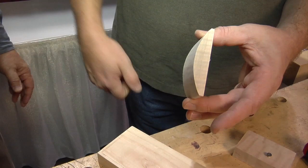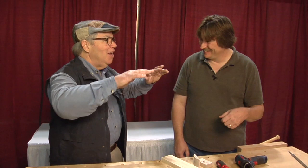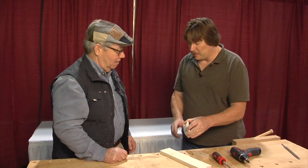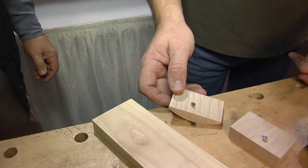That's the quick and easy way to do a scratch bead. Can you stop short? I can bring it up to the end and scratch bead across the end, bringing it right into the corner — so if you were doing a drawer front, really easy to do. On the ones I make for my shop, I make the outside round, so I can move the screw around and actually scratch bead curved surfaces. That's wonderful — so on those lovely cabinets you can just go right around the outside. It works on hardwoods too — mahogany, tiger maple, walnut, anything. You may have to go back and sharpen that screw every now and then, because it's not hardened steel. But as long as you have a file, you're good.